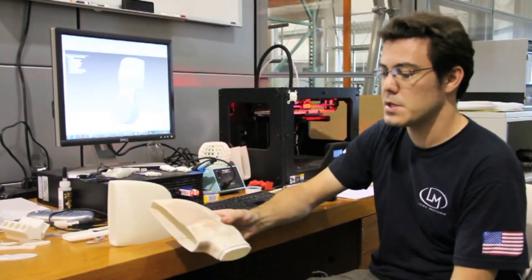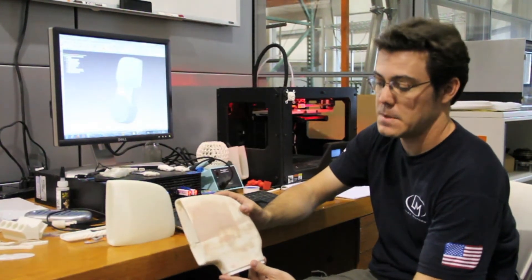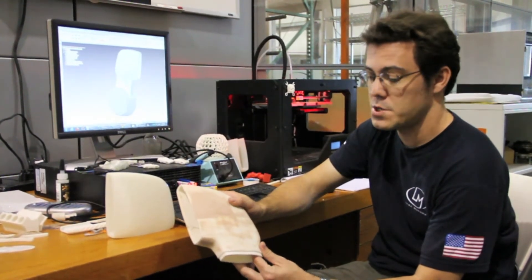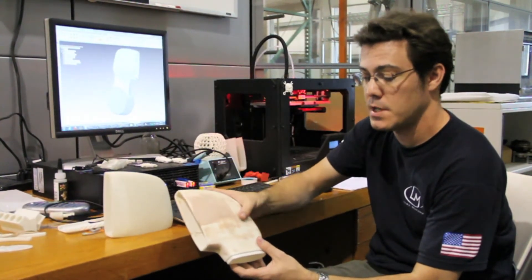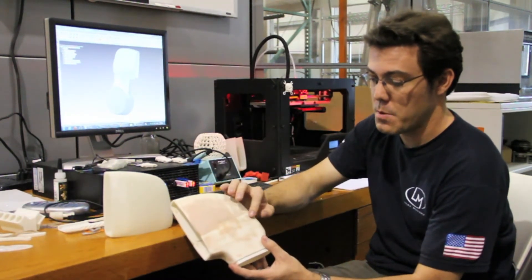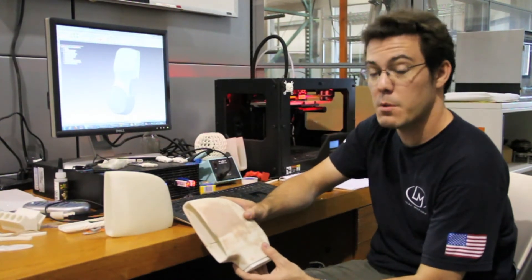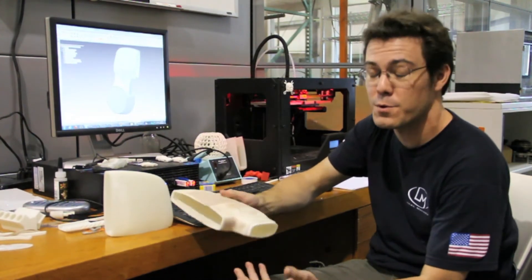This piece is basically the same thing but it was split down the middle. We used this as an experiment in different methods of joining together two 3D printed parts, and we found you can be very successful using a combination of structural adhesives, the actual design of the part — it has a flange in there so it fits together only in one way — and then plastic welding. We managed to plastic weld the seam using just a soldering iron and some scrap pieces of PLA. We also used this to experiment with different finishing techniques, and Bondo actually works pretty well, just as if you were doing finishing on a car.